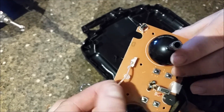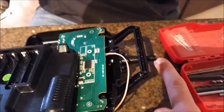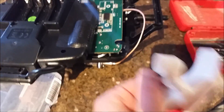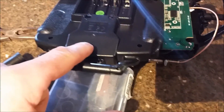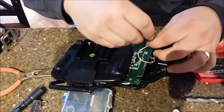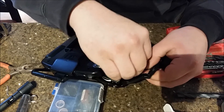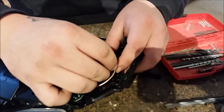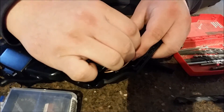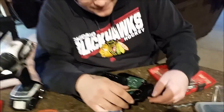All right, let it cool down, clean it up, and then we'll come back. Now the problem is I need to keep the phone clip piece on here for the first-person view. So what we're gonna do is drill a hole right here and the antenna is going to come out of the back. The wire will be tucked down just under the circuit board — we should have just enough clearance. Fingers crossed — he's gonna drill a pilot hole and we'll come back.